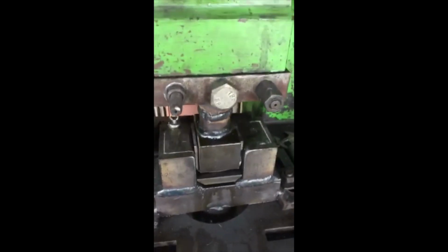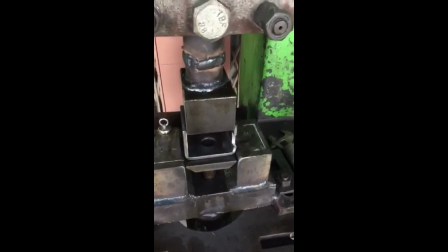And the adjustable stumps, rather than just replacing it with a steel stump: in the future, if that steel stump sags or sinks, you need to shim it up, and then you end up with bits of timber stuck on top of the steel stump to bring your house up to level. Or worse still, if you need to pull your house down for some reason, you've got to cut it off and put a new piece on. But if they just replace the steel stump and put an adjustable top on it, then they could pull the house down or push it up at any time in the future, and that saves doing another expensive repair on your home in 10 years time or 20 years time, or in some places where the soil moves a lot more, you might have to do that repair in 5 years.